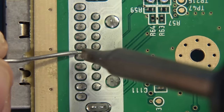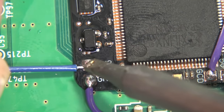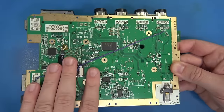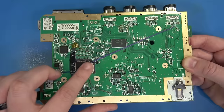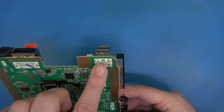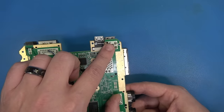Let's bridge these two connections and carry a conductor from the 3-volt pad to the AV out. All of our conductors are soldered properly, and our GameCube controller line is anchored by the FFC interconnect, bound by the actual connector itself. There's only one thing left in terms of soldering — our USB ports. We're going to take the small interposer with a mini HDMI and affix it over the USB ports. Let's get this lined up and installed.